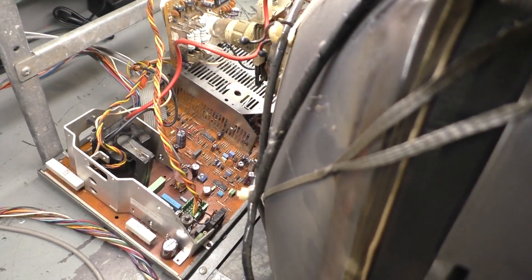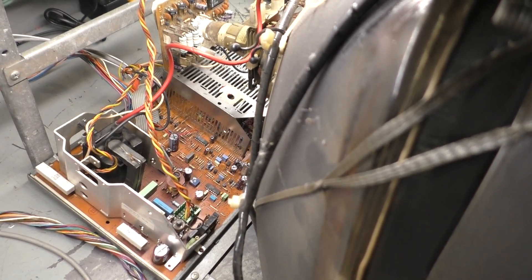Let's turn it on and you can see what's happening. I have a video signal and power — we're all hooked up, ready to go. Okay, it fires up and here is what it looks like: raster lines. And no matter what — see if I turn the screen pot on the flyback, all the way down, all the way up — it's just an all-white screen. Nothing I do, no adjustment makes it go away.